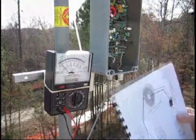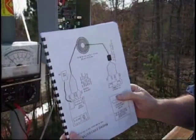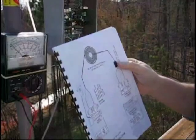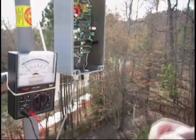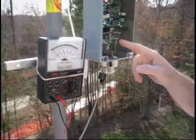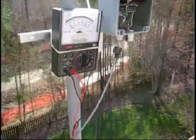Here's the cable diagram that comes with the transmitter — it pretty much just shows what I've shown you. And there should be a ferrite actually on the cable; we haven't put that on yet, but I have it right here. The ferrite goes on the control cable and limits RFI coming out of the box and traveling down the cable.